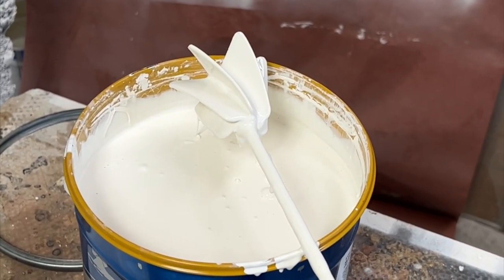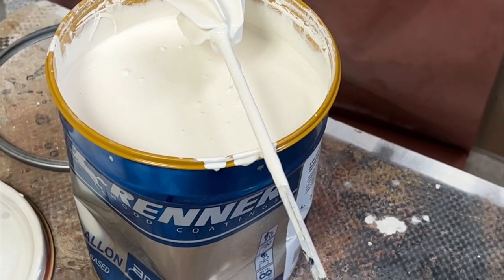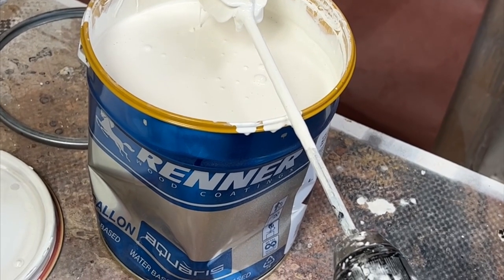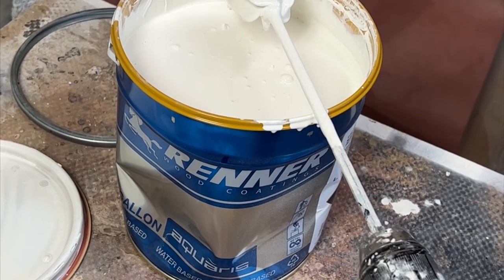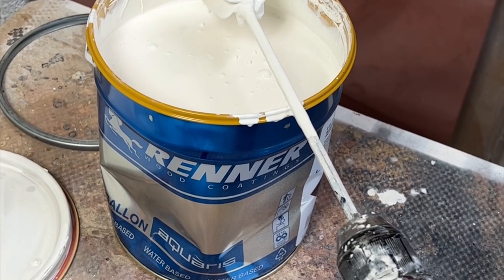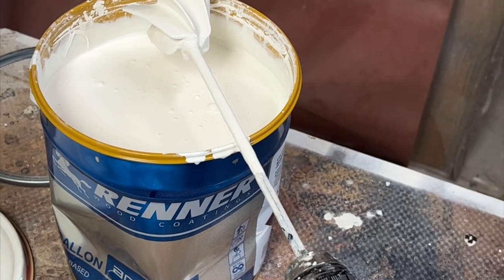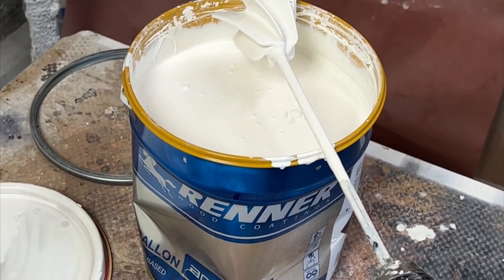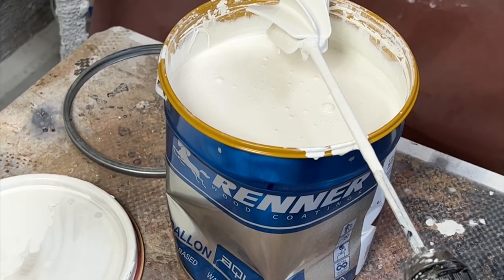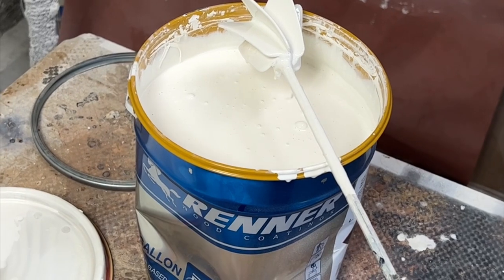I'd also add about primer — you're going to tend to use a little more than two ounces per door per coat. You'll probably use closer to three ounces, and that's what I aim for. Primer tends to be a little more high-solids than the top coat. I usually calculate around three ounces per coat for primer and two for top coat — that's per side per coat. I like to do two coats of primer and two top coats, though I've gotten by with just one top coat. I've kind of come to the point where I like to do two light coats of all of them.